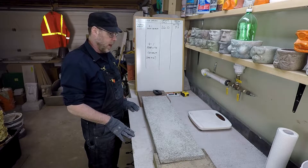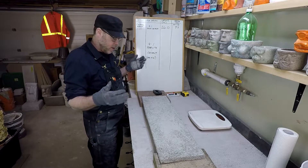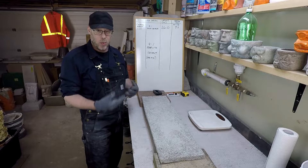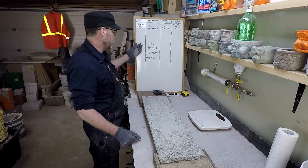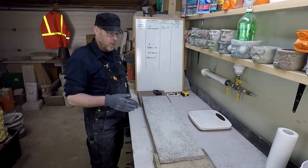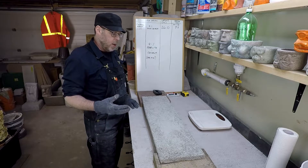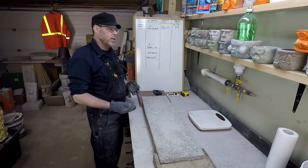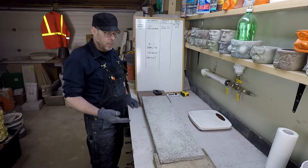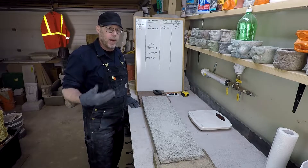The control piece was 26 pounds and was able to hold 94 pounds before it broke. To verify the parameters: we're working with a 28-inch span, the test piece is one inch thick, and there is no reinforcement — no steel, just perlite, just cement. It was a dry mix constitution such that it wasn't able to consolidate fully like a more liquid mix would, but the lower water concentration might achieve a stronger overall result, since concrete is often overwatered. Something more along the lines of damp sand would be optimally hydrated.